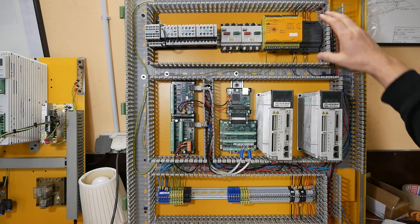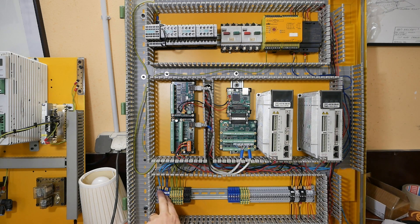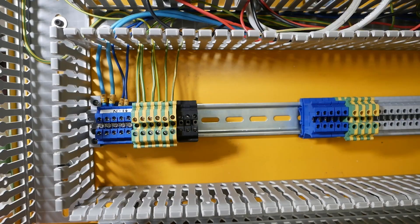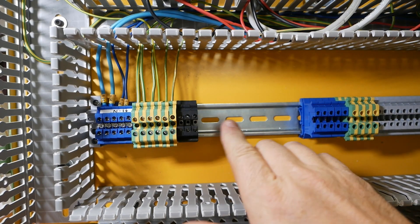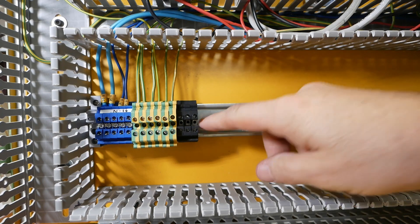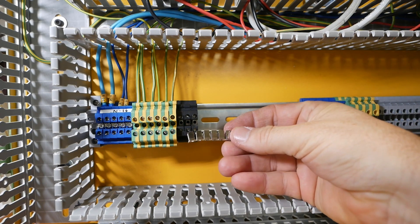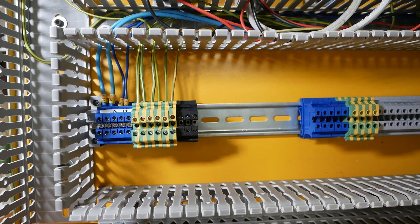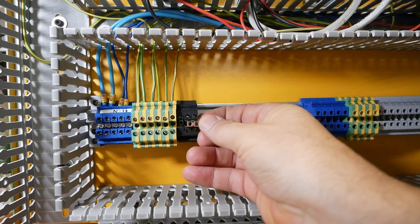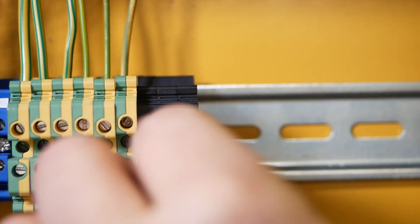Now with the bulk of the DC power supply done and distributed, the neutral is distributed, and the earths are mostly connected, I'll now connect line one, then line two and line three. These terminal blocks can be jumpered — the jumpers come in a little bent plate like this. You just cut off as many as you need; in this case three will be enough. Click them on and put screws in each of the holes.